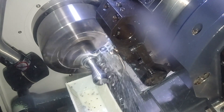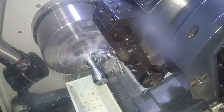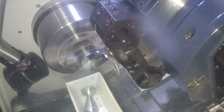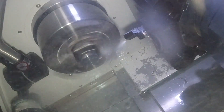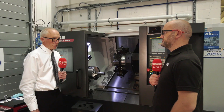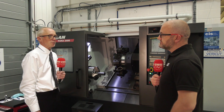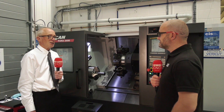So in terms of the part off, what are we looking at? We're looking at the GX34. This is a double-sided insert that enables us to part off bar up to 65mm. So we've maintained the rigidity of a top clamp holder and we don't have to use a parting blade, even for large diameters.